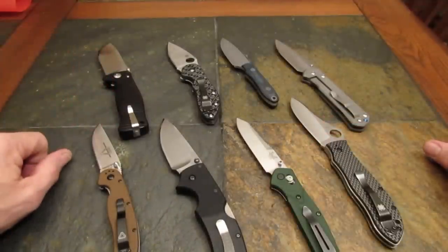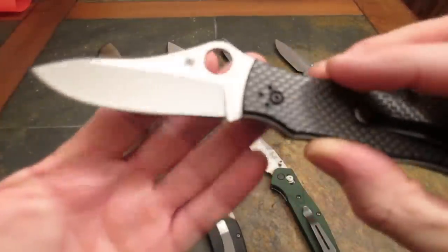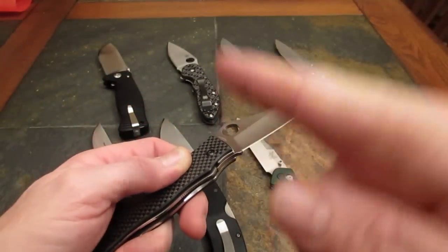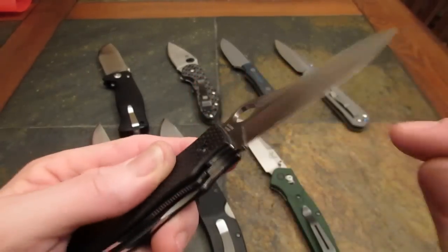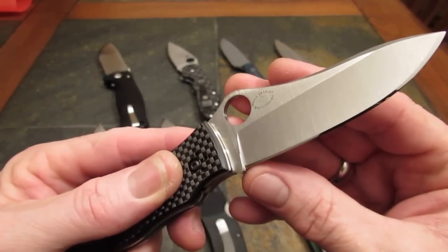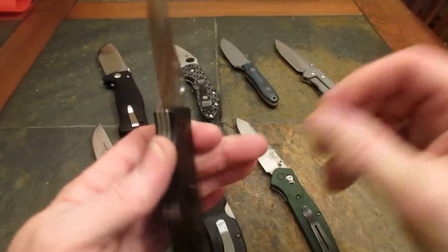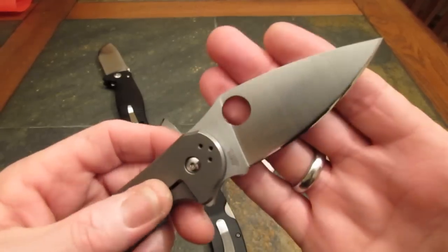Let's talk about the two Spydercos. The Gale Bradley is stock. You can see I had to work quite a bit at the base of that edge. Even though Spyderco tries to make sort of a 90-degree plunge, they don't quite get that done. There's always a little radius or chamfer at the base of that plunge and it causes problems — you end up with a funny little scallop at the base of the edge that tears up your polishing tapes. I worked the corner of my stone into the base of this edge pretty hard to make it straight, and it came out well but it took a lot of work.